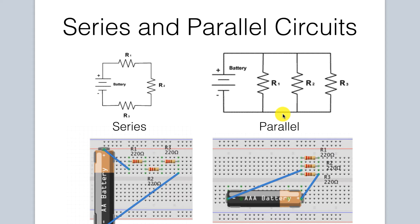The other circuit configuration is a parallel circuit. In this setup, the voltage applied to each resistor is the same, but the current splits up. Current leaves the power source and splits up, flowing through each resistor, and then collects again before returning back to the power source. If the values of the resistors are different, the current flowing through them is different. However, the total sum of the current entering the resistance is equal to the total sum of the current leaving the resistors going back into the power source. This is known as Kirchhoff's current law in electronics.